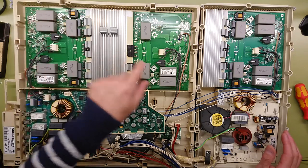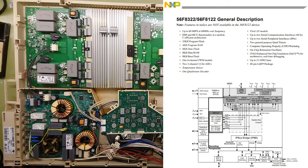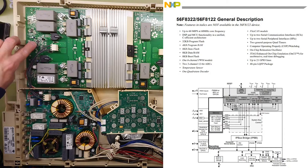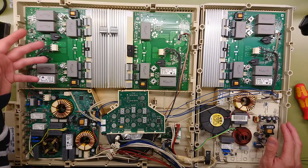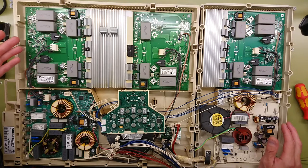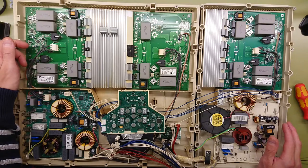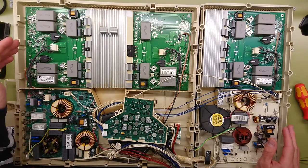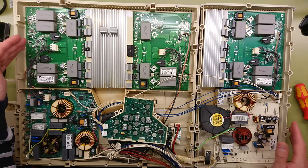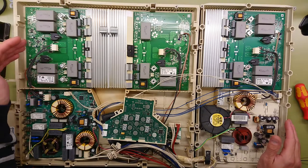The individual boards are three identical power inverters, each controlled by a Freescale MC56F8322, which is a combined DSP processor and microcontroller. It can do 60 MIPS at 60 MHz and has all the peripherals needed to drive an inverter: a six-channel PWM module, three-channel 12-bit ADCs, 21 general-purpose IOs, and it is specified to run a FlexCAN bus. So the two-wire bus visible here is likely the CAN bus. It has program flash, program RAM, data flash, data RAM, and a boot sector — a lot of capability in a small package.